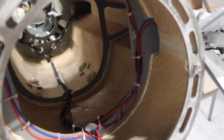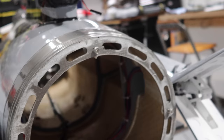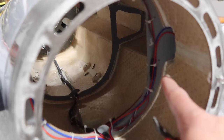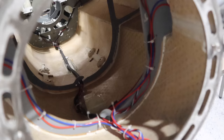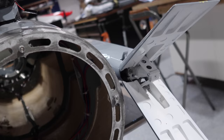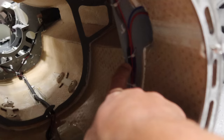While we're waiting for our chute mechanism to print, we're going to continue on the back end. First thing we need to do is loosen up all of our items back here — we've got airline, light lines, servo lines, and all of that stuff needs to be heat protected. But first we need to take our rudder servo out and get that set up. Then we're going to take our air brakes out, Loctite all the items on the air brakes, and confirm we're happy there. The servo line comes all the way down to this connection point right here — another reason we need to loosen up all our zip ties.